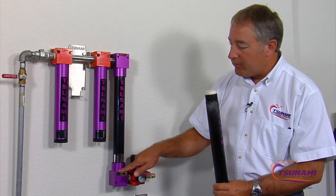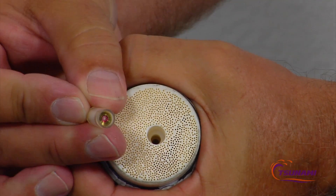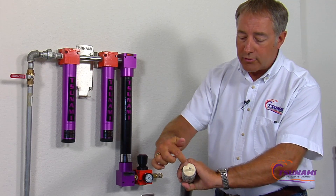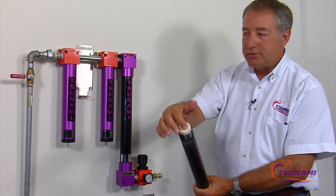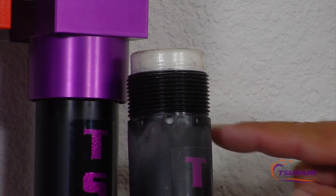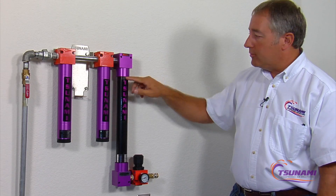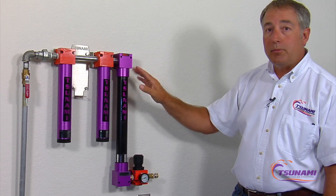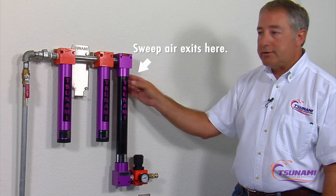At the very bottom, we come through and run through this little orifice right here. We take a small amount of air, approximately 3.3 CFM of air. That air flows backwards, up and around the outside of all these small tubes. So as that humidity is coming on the outside of those tubes, we take that dry air and force that humidity up through the top of this membrane. There's a series of holes in here, so when you turn this on, there's a controlled leak right here — you'll hear a little bit of air that seeps out continually, about 3.3 CFM. This is where your air is actually being dried. The humidity that's in the air is coming out right here.